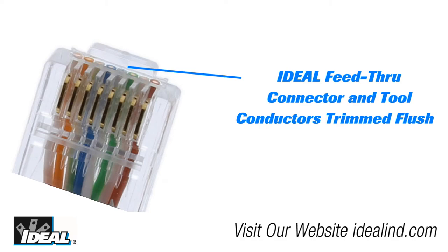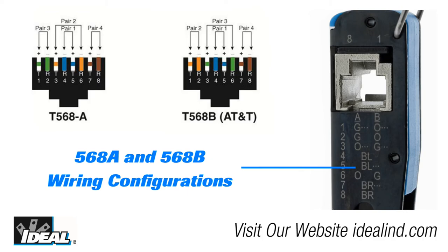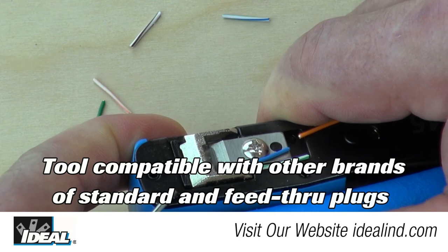The custom replaceable heavy-duty cutting blade will last for over 2,000 cuts. We've even added the 568A and the 568B wiring configurations to the side of the tool. The IDEAL feed-thru RJ45 modular plugs and FT-45 crimping tool are designed to simplify and improve the consistency of cable-to-connector termination of Cat5e and Cat6 modular plugs to twisted pair cables.